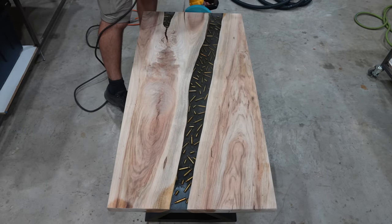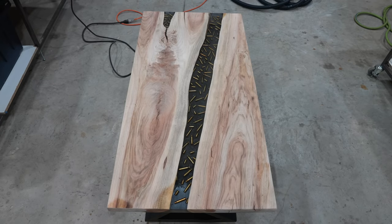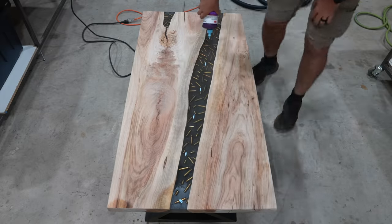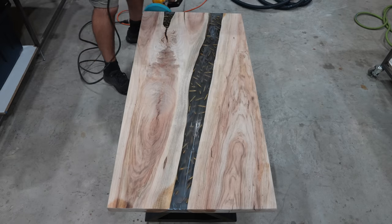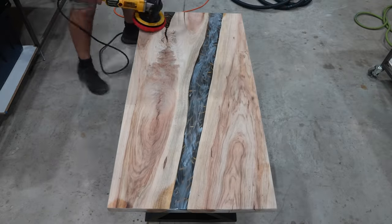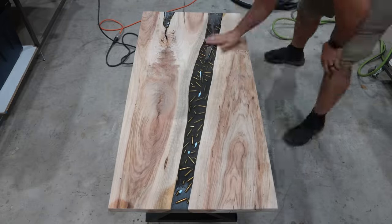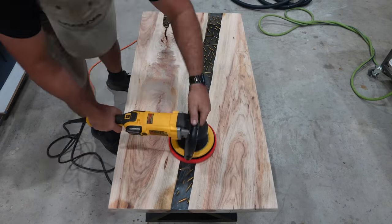You can tell that the epoxy is becoming even more clear at this point. After wiping it down with a microfiber towel we move on to the third buffing compound — the number on the bottle should be 06068. Apply a few drops, spread it around with your finger, and buff it in using that same blue polishing pad. After that, switch over to a red polishing pad — that's a T20 finish polish — and repeat the entire process: compound one, wipe it off, compound two, wipe it off, and then compound three. By the time you finish polishing with compound three you should notice a significant difference in clarity.